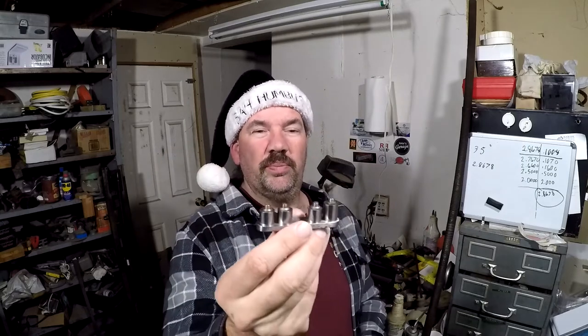The other thing he sent me was this. And when I got it, I knew I'd seen it before but I couldn't remember what it was, so I had to look it up. These are Brown and Sharp number 758s, and they're toolmakers buttons. You would place this onto a part and use gauge blocks and stuff to line this pin up. It's very accurate — lapped to a very precise cylinder so that you can indicate parts on a lathe or a mill and know exactly where you are from an edge.